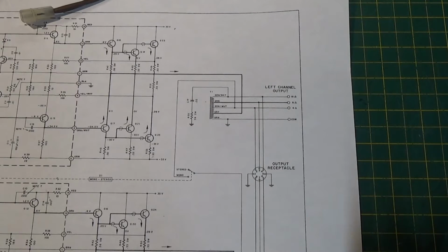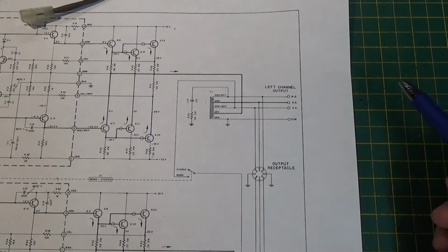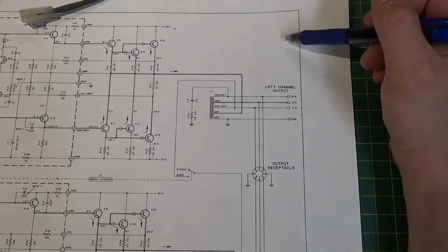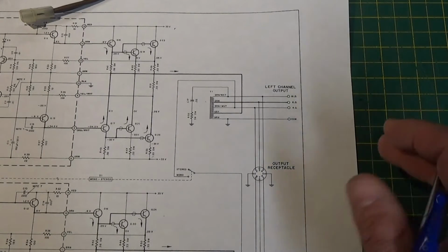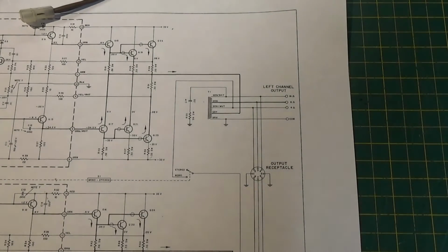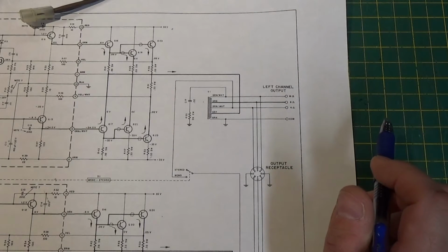And of course, being that Verdin bell tower being a commercial device, a lot of times the bell tower speaker is very far away on top of the steeple or wherever you're putting it outside the building, and you're going to take this and step it up so that there's no line loss of the speaker leads that are going 150, 200, 300 feet wherever they go. And then you have a matching transformer on the bell speaker that's up in the tower, and you step it back down to speaker level, which would be 8 ohms or whatever. Okay, so it has that, and then it also has a 16 ohm tap for old-fashioned 16 ohm speakers, which unfortunately we don't use those anymore.